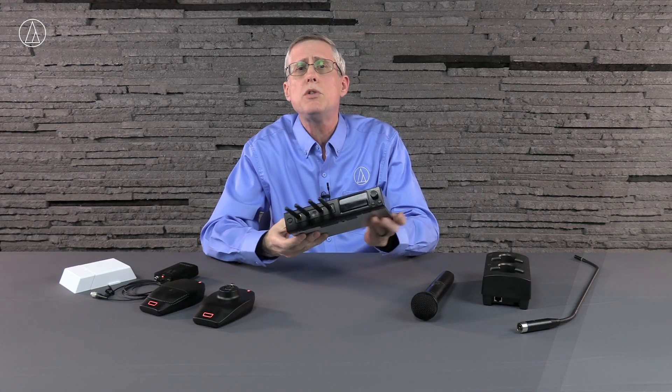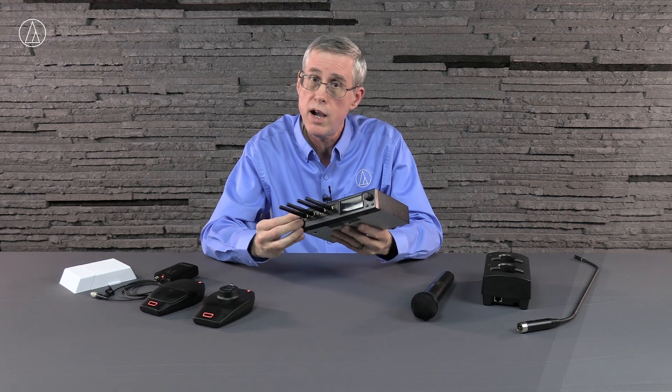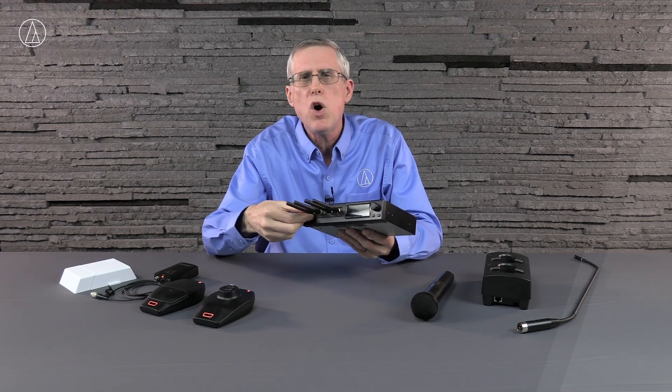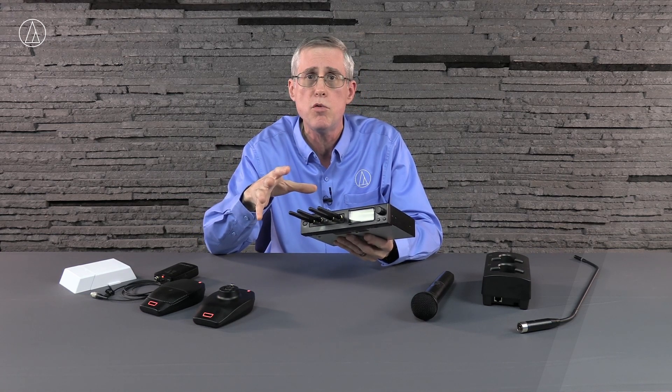In the future, we are going to do a video talking about just why that is, but I do want to touch on one of the reasons that really helps us succeed in that, and that actually has to do with the antennas themselves. When you're talking about a traditional UHF wireless, you're typically putting antennas on the end of an RF cable, and that's how you solve that application. But it's a little bit different when you start talking about the antennas on a device that's working in higher frequencies. Here with the 2.4 gigahertz device, the antennas are smaller, the cable is much more fine. There's actually a lot more loss, plus that cable is a lot more expensive, and that makes it very difficult to remote mount them.